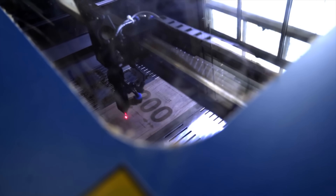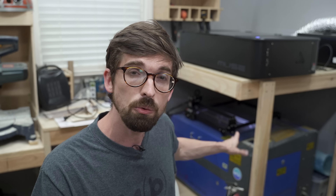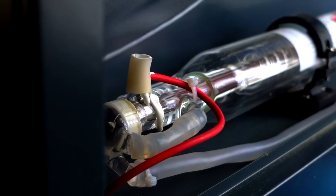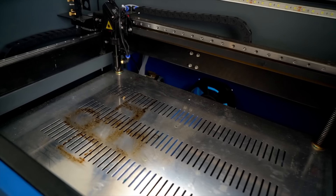So we're actually going to step up a good bit to my next recommendation. This is my budget-minded CO2 laser — that's actually mine, the blue one sitting behind me. I spent my own money on this after a ton of research. You might be wondering what's the difference between diode and CO2. We won't get deep into the actual physics of how it works, but the big thing is they're way more powerful. They also have a big massive laser tube in the back, so they're a lot bigger and more fragile because there's a big piece of glass. But you jump up from like four or five watts to in this case about 50 watts.